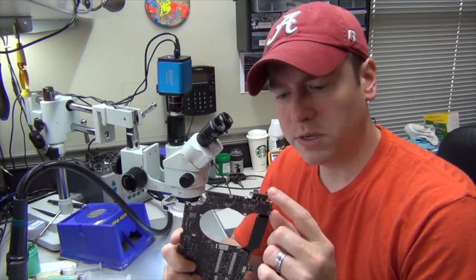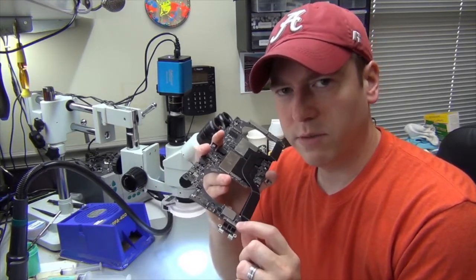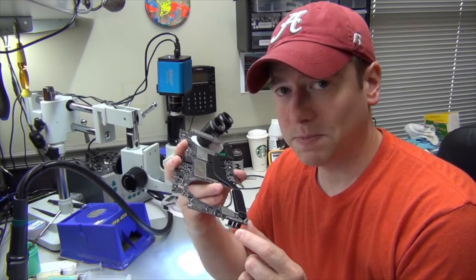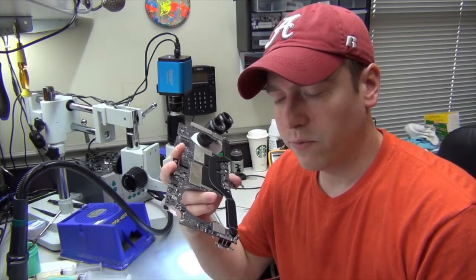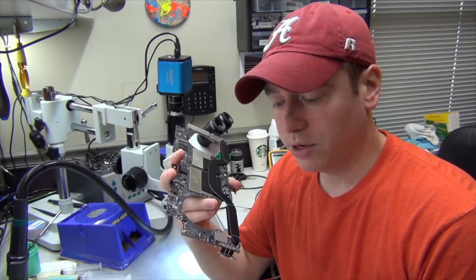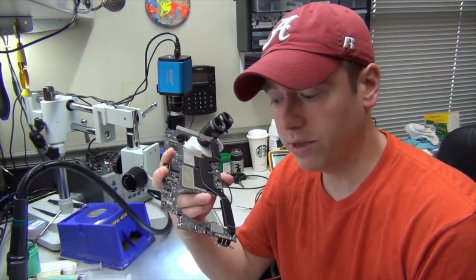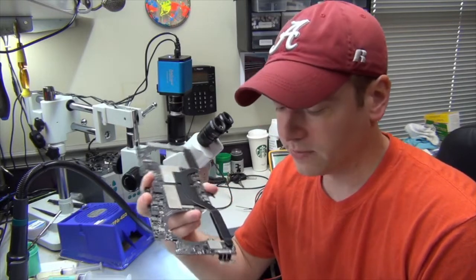Remember, like I explained in the 12-inch MacBook, that had only one of these USB-C ports. This is your input for your data and output data, and also this is where you charge your unit. So the same connector here does everything. It does all your inputs, outputs, and your charging. So in order for the machine to know whether to send the voltage to the battery to charge it, or to the machine to power it on, or to the chips to process the input of a thumb drive or a hard drive plugged in externally, it has to have a controller chip or a MUX chip that sends the signal to the correct place.